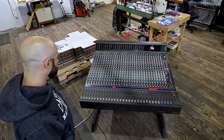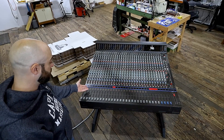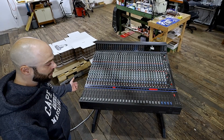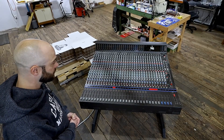There are three dynamics modules buried underneath the channel strips and they're obviously not doing their job. Maybe it's caps, but it could also be a voltage issue — one of the power rails maybe a little bit too low or something, and that's adjustable, so I'll take a look at that first.